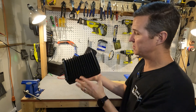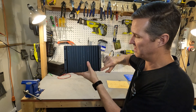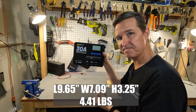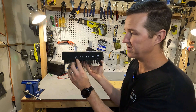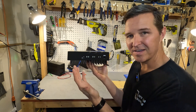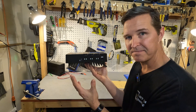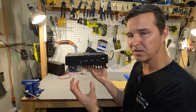On the back you can see a pretty beefy heat sink along with some screw holes to hang this on a wall. I'll go ahead and put the dimensions and weight right down here for your reference. Also on the front side, along with the wiring screw terminals, you have a temperature port where you can connect a temperature sensor. All that does is monitor your lead acid batteries — if they're too cold it raises the voltage a little bit, and if it's too hot it lowers it.